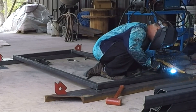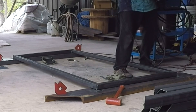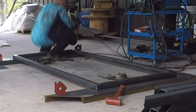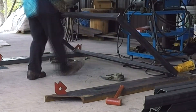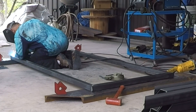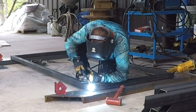A little bit about the welding equipment: I bought a Miller plasma cutter and a Miller 2015 welder. They're awesome — the welds are amazing. I did change quite a few tips on the welder; they get fouled up especially doing the inside 90-degree welds. I think I went through four or five tips. I just switch them out — I buy them in bulk. Anyway, each window frame took me roughly 15 to 20 minutes max, so it wasn't that hard or slow. I was impressed I got everything done within a day and a half.